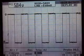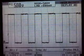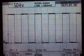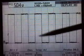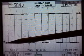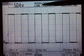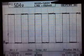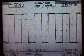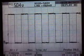Now we're going to highlight the bottom cursor. After you do these a few times it gets really easy to use. We're at the A-line — the little rectangular box indicates the zero voltage line for channel A. We're at the top of the pattern, and our voltage comes up on the screen at 5.04 volts. This would be a typical reference voltage.